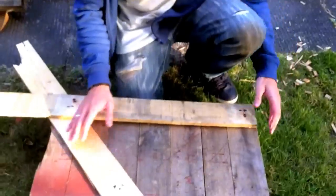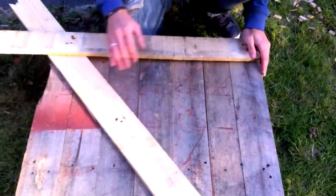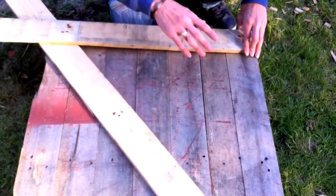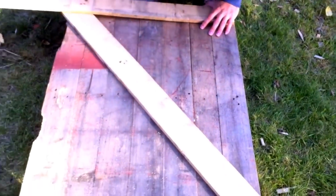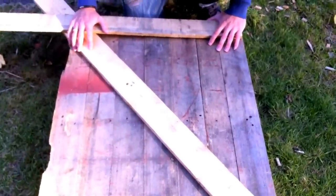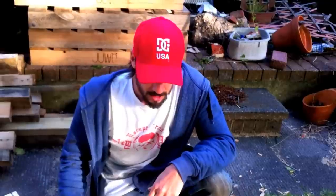So the found door is a no go, so I've decided to make it out of pallets. I'm going to put an outer frame on — one at the bottom, one at the top, one down each side — and then a diagonal structure for support. It's going to give me an extra space so I might even put a barn door in it now, giving me an opportunity to open the top section during the day if it gets too hot.